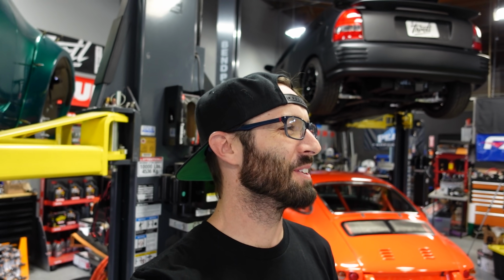Quinn brought up a good question. Why go through all the fuss of making sure that this looks purposeful and looks good if it's just going to be tucked in behind the rear box? Well, the way that we're designing this subframe and the coolant loop is we're going to include the drive unit and the charger DC-DC on the same coolant loop, and we're making it so that this subframe can drop out without having to drain that coolant system.